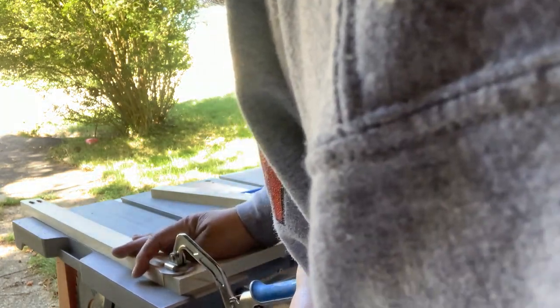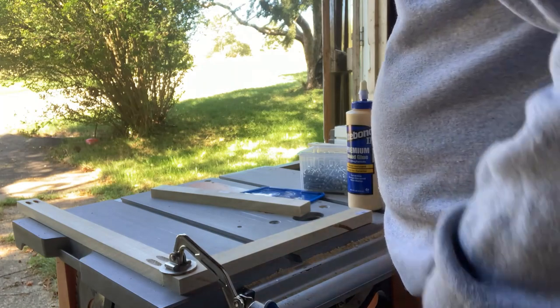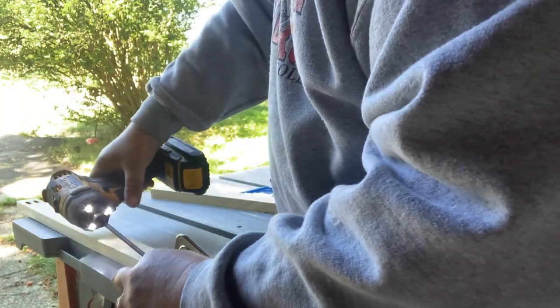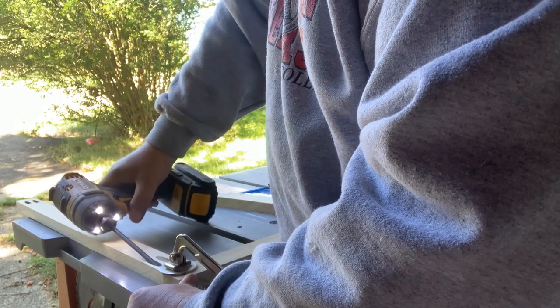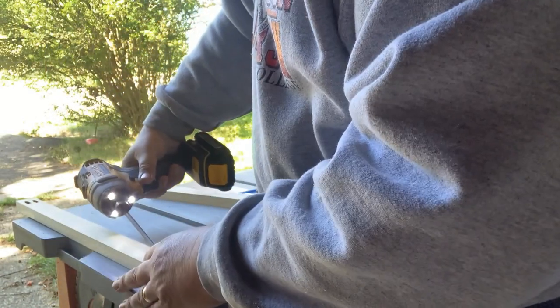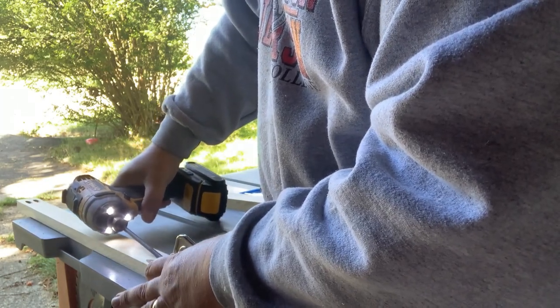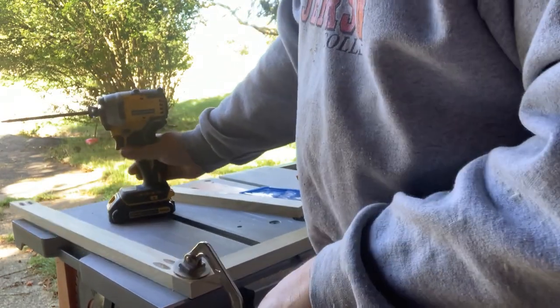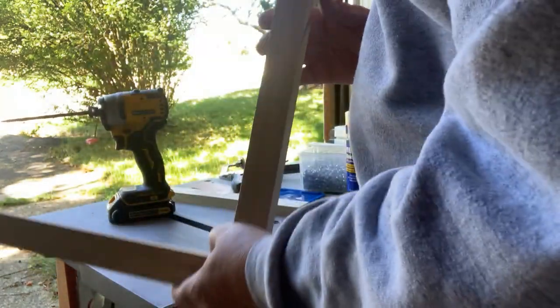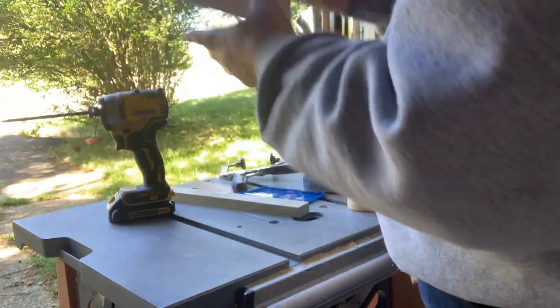My face frame is flat against the surface of the table. Take your pocket screw — don't go fast because you don't want to rip out through the wood. You hear it change just a little bit? Tight. It just sucked in nice and square. The important thing is that your cuts are square and true. That's one side done. Because we have a groove that goes all the way through on this piece but stops on the rail, we'll put the other long stile on first, then slide our last piece in.